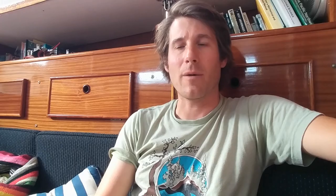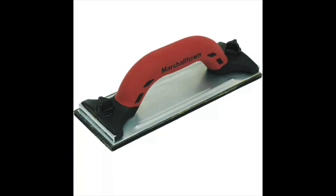Having now done the wet sanding method, I will not be going back to dry sanding. It's so much easier and goes really fast — you don't have to tarp the boat up or wear respirators. You're basically just using drywall sanding screens, constantly dipping into a bucket of water, spraying the hull down, and sanding away. We only used about two or three sanding pads for the whole hull and it only took the morning into early afternoon. No dust, no respirator — it's definitely the way to go, and I'd highly recommend it.